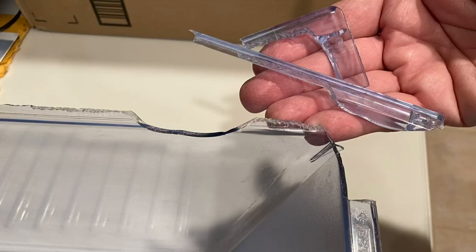I had a broken refrigerator drawer and I planned to use the staples and then solvent weld it afterwards to make it extra strong. The small squiggles go across the break. I'm throttling the trigger on and off. I put it against the plastic before I heat it up because it's only an eighth of an inch thick and I don't want to burn through it. You can see it goes in very quickly.